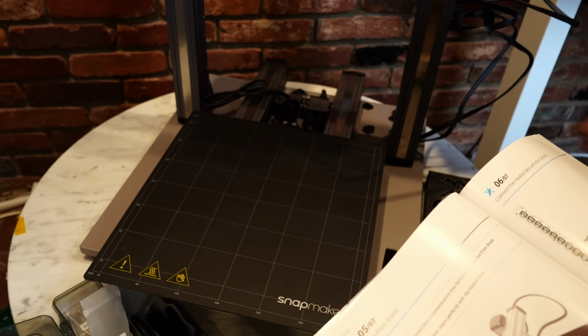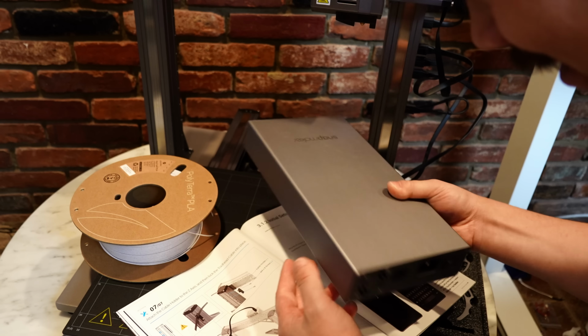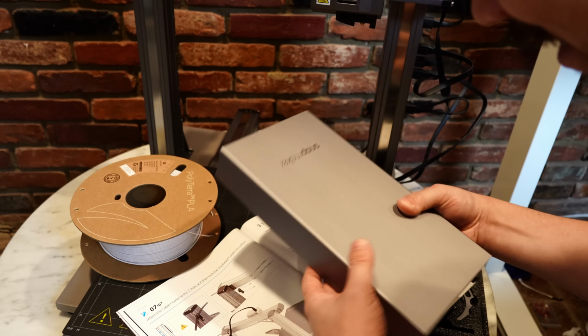I understand that if you're doing CNC work, you'll want this to be isolated somewhere where it won't be able to get damaged. If you're making aluminum or wood chips and having them getting sucked into the fans here, that could cause some major issues. There are ways around that, like if you elevated this up high, put it up here somewhere, or put adequate filtering in front of the fan intakes, then you could probably get away with having this integrated onto the machine somewhere. But this is the way it is for now, and we're just going to use it like this.